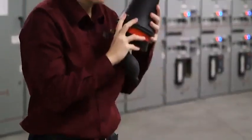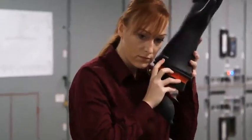The only difference between classes of rubber insulating gloves is the thickness of the rubber and their length. Any damage that impairs the thickness, even though the rubber insulating gloves may hold air, will eventually lessen or eliminate its effective protection.